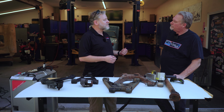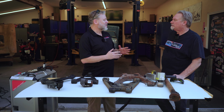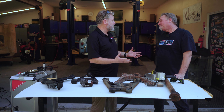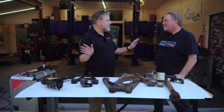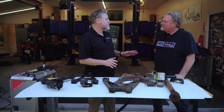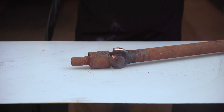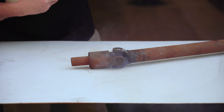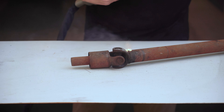You fire this up and you don't have any of the prep work you need to do. If you have wires going to a component, all you need to do is tape them up with blue painters tape — it doesn't affect the wires at all. If you accidentally hit it, the laser doesn't affect those certain surfaces. The problem with sandblasting is that when you put a car into one of these sandblasting units and it still has hydraulic lines on there, if that sandblaster hits one of the hydraulic lines, it's over with. With this, no more sandblasting, no more glass pellet cleaning, none of the consumables. It's a lot healthier for the environment. If you're media blasting stuff, you don't put greasy stuff in a cabinet — it puts grease into your media, which clogs your gun.